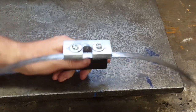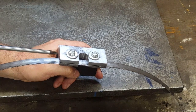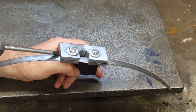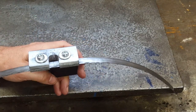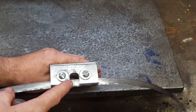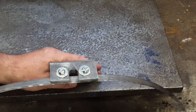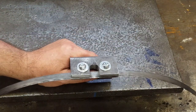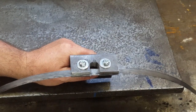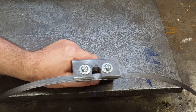Here's our finished product. We took a simple piece of angle iron, sawed it off, trued everything up, and milled that slot in there for the blade to sit into — 20 thousandths of an inch deep, because the blade is 25 thousandths, so I wanted that 5 thousandths sticking up. When you put the clamp here on top and tighten it up, it pinches the blade so it won't move. You can see the little spot where you'll do your welding, and I left that opening so you can get in there with your little torch and heat that up. There's the crack in the blade — this blade isn't ready to be welded, I just put it in for demonstration. Just a simple little jig I can bolt in my vise and do the work. In the next video we'll show how to weld the blades together. The big thing is just being able to hold this nice and flat and true so you can get in there and do your weld.